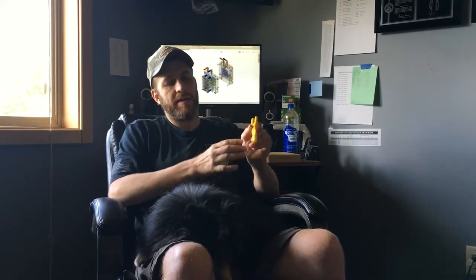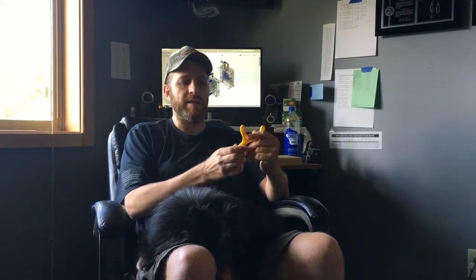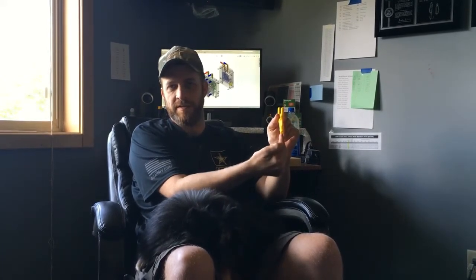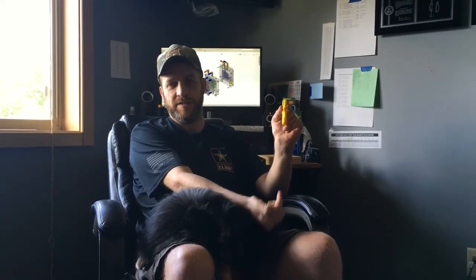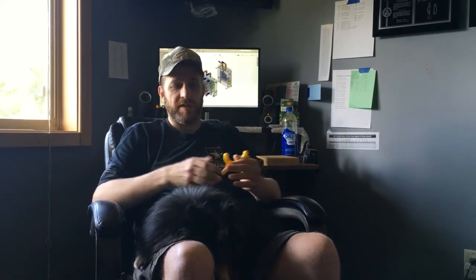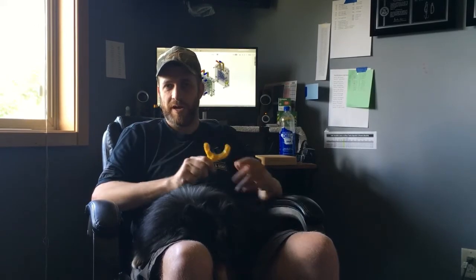The cradle I'm holding has a hole that goes up into the end so it can go onto the rod holder and be press-fit on there. What has to happen is we open and close the tool from one side, and then we have a slide that comes in to make that hole or feature. While the tool is opening, that pin retracts so the part can be ejected off and fall into the parts bin. Some parts have multiple slides, some have none and it's just an open-and-close tool — a lot of neat things going on.